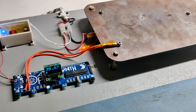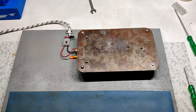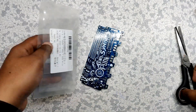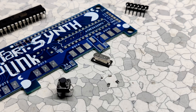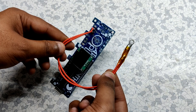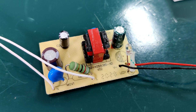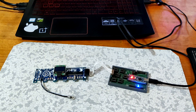These are the things I used in this project: iron element, copper plate, wooden board, AC cord, ESD mat, and the rest of the parts are for the temperature sensor. The PCB was provided by JLCPCB. Other components include OLED display SSD1306, ATmega328P-PU, 16 MHz crystal, 22pF capacitor, 10K resistor, 10K NTC, 5V 1A charger circuit, 3D printed enclosure box, potting compound epoxy and hardener, Teflon wire, red/black/white PCB for reflow, solder paste, and an Arduino as ISP programmer setup.